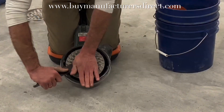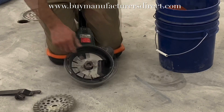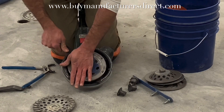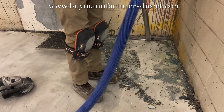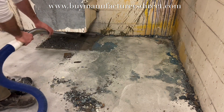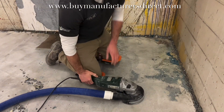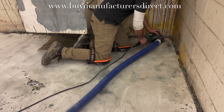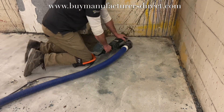Next up will be some hand grinding to remove some of that bulk material. For the same reason a PCD is needed on a big machine, a PCD is installed on the hand grinder to remove some of the material in an area where the grinder could not get, because of the floor undulations, as well as underneath what appears to be a bent shaft. The PCD wheel on the 7-inch hand grinder is used to quickly take away the residue of the material that the big machine could not remove, as well as under that bent shaft where the grinder could not reach.